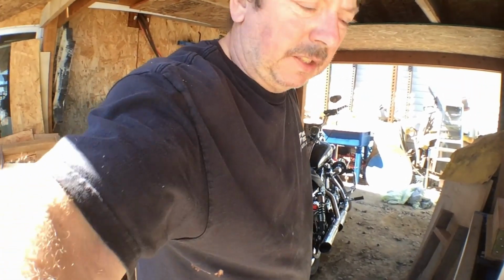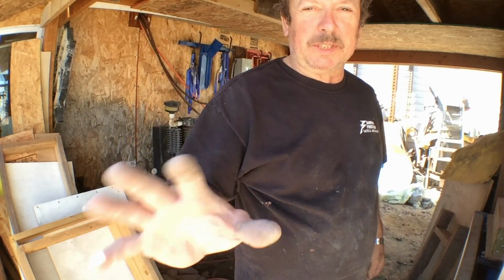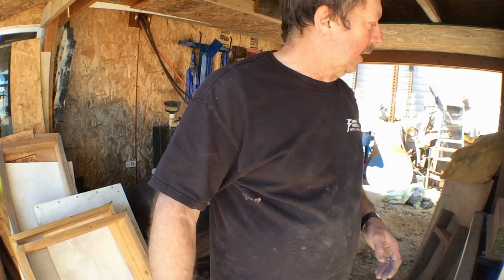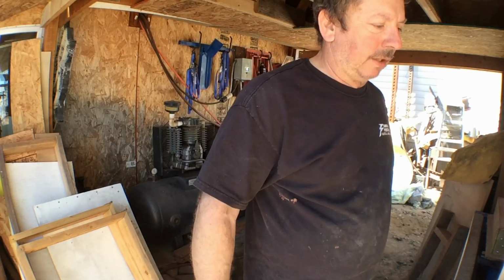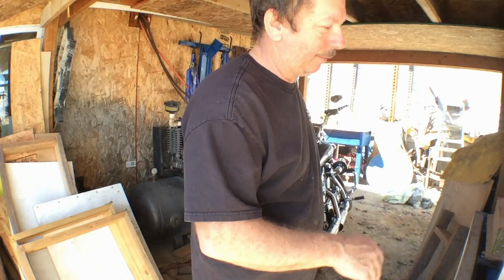Well, this looks pretty good. What I'm going to do, these molds are heavy enough. I'm going to take the bottom portion over. I'm going to set it down on my little casting platform. Then I'll take the top over and put them back together. Now I've already put them together once, so I know we've taken care of hopefully any sand dropout we're going to have and any little pieces that fall off.